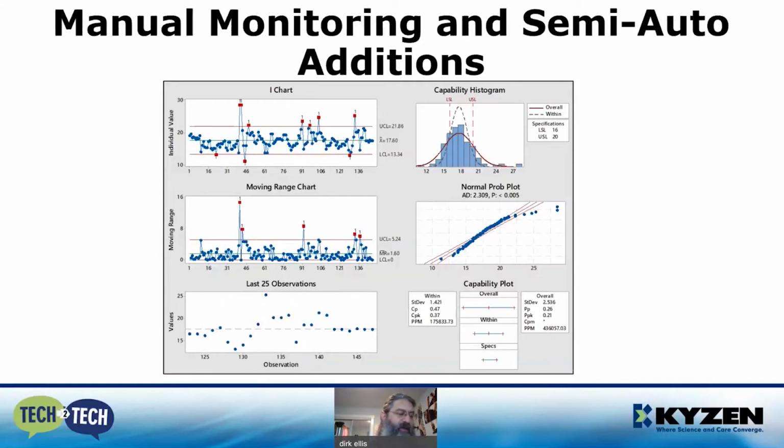This data is from a customer using manual concentration reading and a Chemtroller that were analyzed using Minitab SPC program. I'm not sure I can call this fair control. Their CPK was 0.37 and the PPK 0.21, with many data points outside of their 18 plus or minus 2 control range. I wonder if the boards cleaned at 12% were clean.